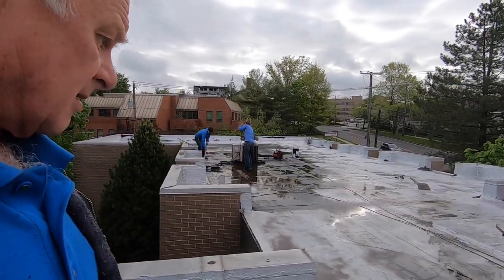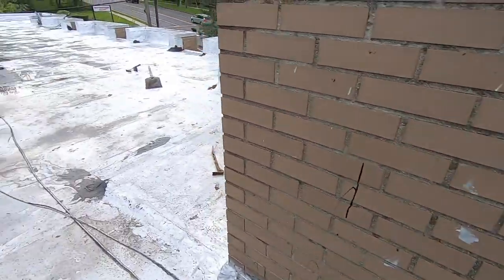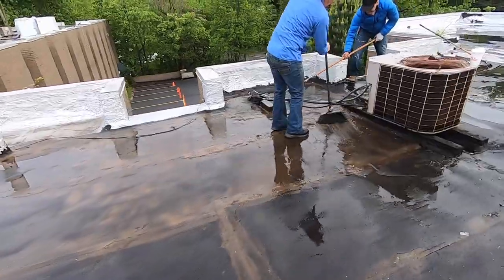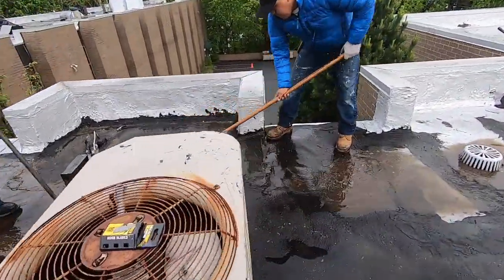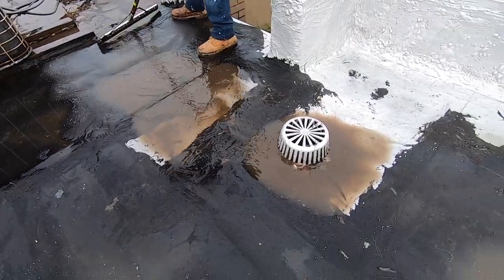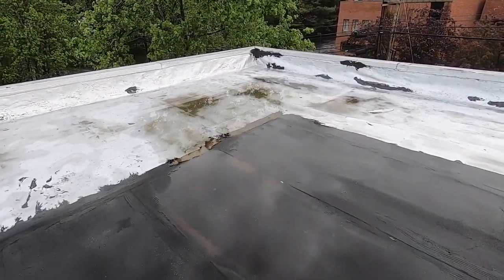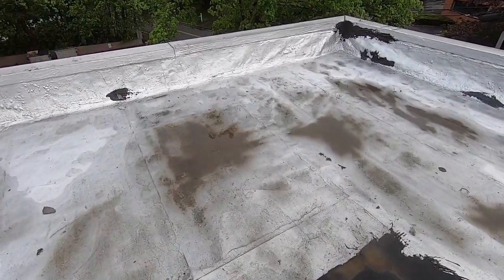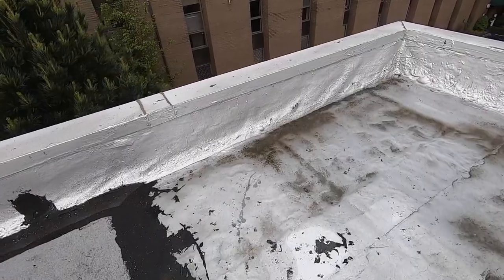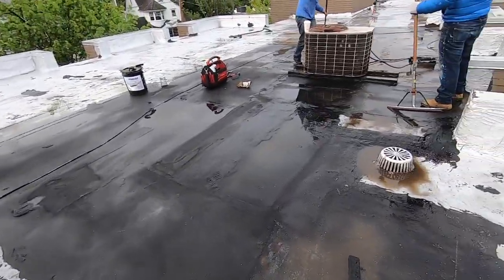This is going to be a big area to fix — the flashing. So we're removing this water right now from this pond. Then we're going to cut through this area right here to make a channel right to this drain. There's a little bit of water sitting here but I'm not concerned — it's not a big deal. Most of the water will go. We'll cut it open and release the water to the drain.